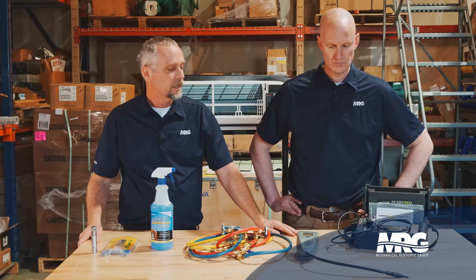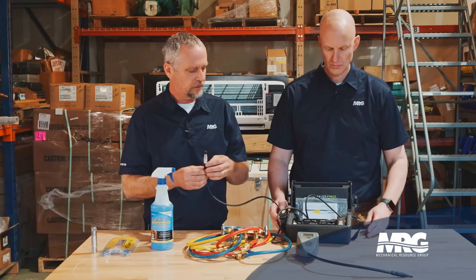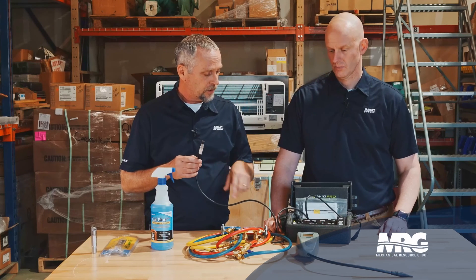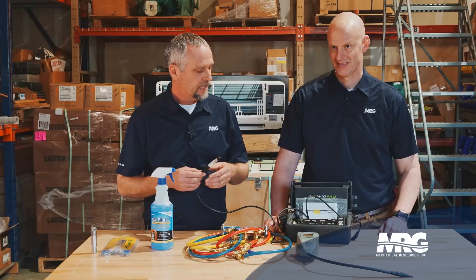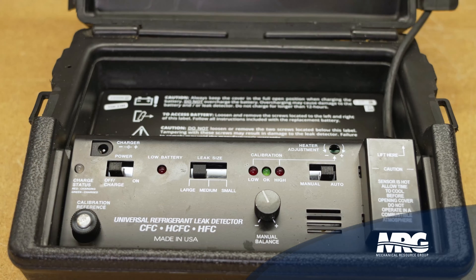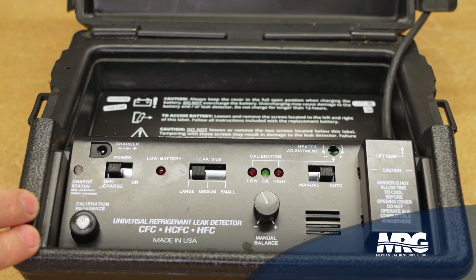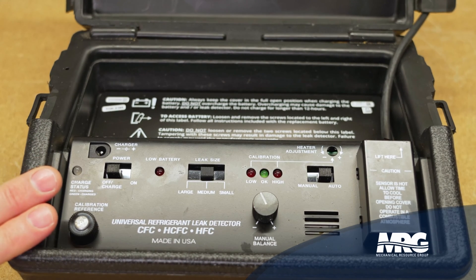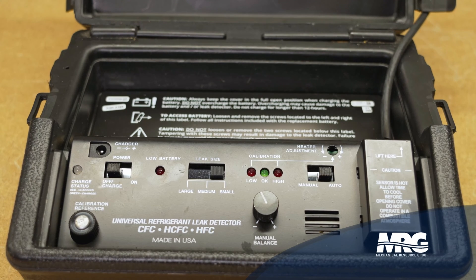It's got a little air pump just like the other one, pumping and sampling air across the tube all the time, looking to pick up refrigerant. An important maintenance item on this one is calibration — you've got to make sure it's calibrated correctly before you get started. There are several leak size ranges: small, medium, large, depending on what size leak you have. I like to start off with the setting on large — that'll get me close to the area of the leak. It'll ring out quite a bit but won't pinpoint it. Once I'm ringing out and close, I'll switch to medium, then small to pinpoint it exactly.